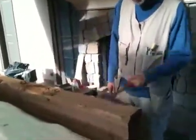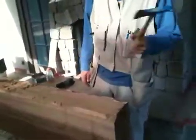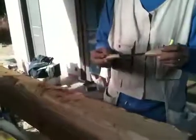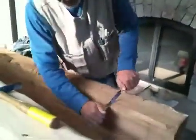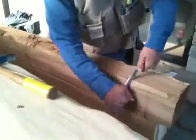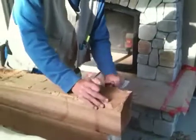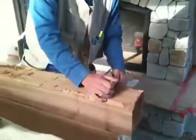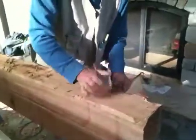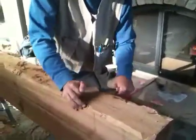And then I go back to my adze and I make some little marks like this. These are like just the marks of the axe when you first log this beam out of a big tree. Then using this draw knife, that is a flexible blade, I clean up the jaggedness of this, because we don't want the wood to look brutalized and, you know, abused and mishandled. There has to be a certain care, a certain sense of the windswept, weathered look to it, and then when that happens on old wood, it usually takes all the hard edges. Everything becomes a little softer and rounded.